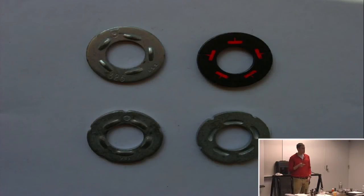We were told that with those types of squirters, because we paint most of our girders, the paint won't adhere, that's why we don't use them. That silicone blows away. If you pressure wash your steel, that silicone's gone. The problem is when that squirts out, it's dry silicone, and if you've got any breeze out there, it's gone in no time at all. It blows away. It's dry and hard.